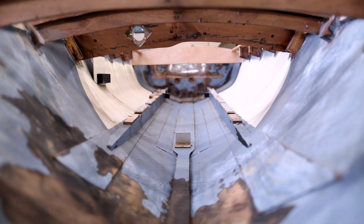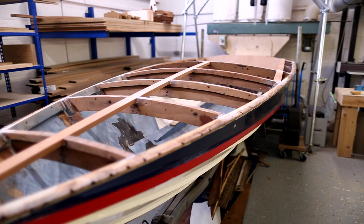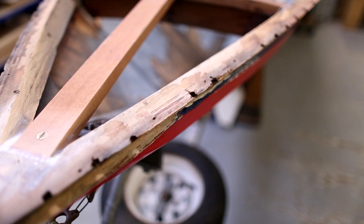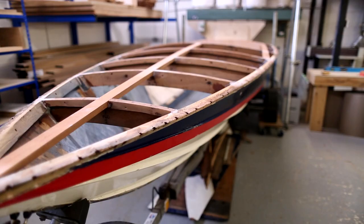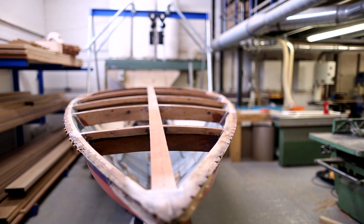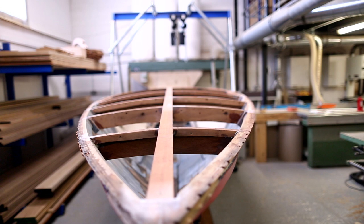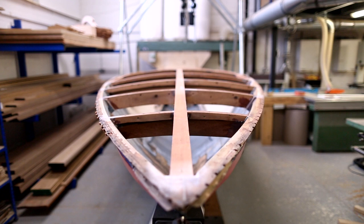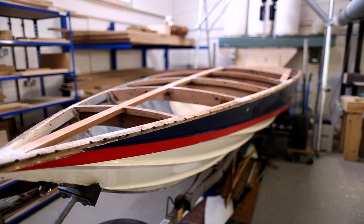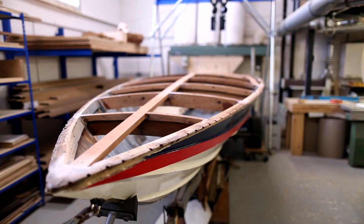You can see there's no framework to the boat other than the deck beams. These are just a cold-moulded hull made of diagonal layers of veneer laid up over a mould, which makes these boats really strong and lightweight. You can just see the top edge of the veneers where they finish. This boat actually has six layers of veneer, which makes the hull 12mm thick in total - that's the most layers I've come across in any of these boats. Generally the Tremlet boats were built with three layers, and you could order an additional layer to make that up to four. This was obviously beefed up a fair amount - it's the thickest hull I've seen from any of the Stapleys or the Tremlets, and perhaps that's the reason the hull has survived quite so well.